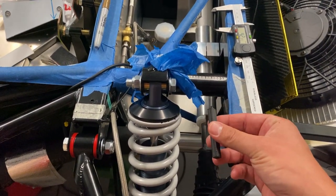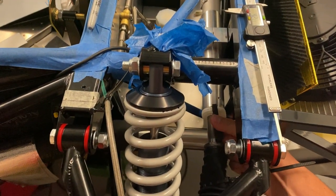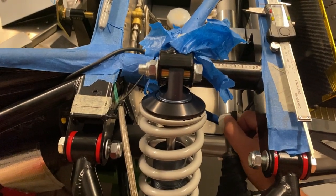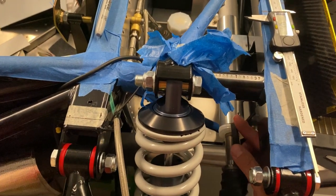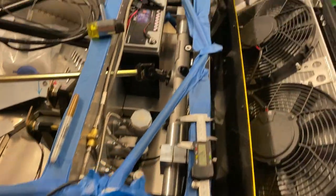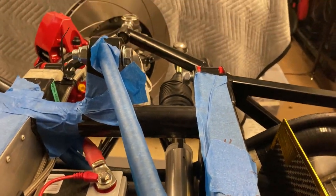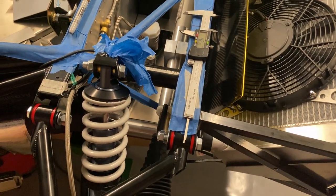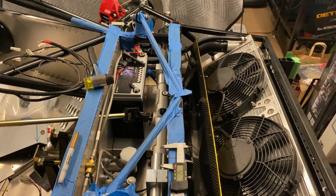I 3D printed a couple of locking tabs which fit fairly perfectly and should do the job now and into the future. Obviously you could just knock some up, but it took me two seconds at work to print these. I've got the same thing on the other side — it was an accurate way of doing it and should get us out of trouble. We'll also leave them in place when we set the suspension geometry, because you do want the rack centered when doing that.